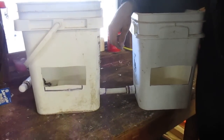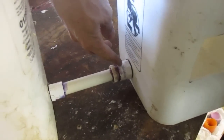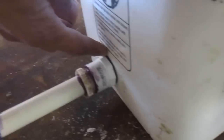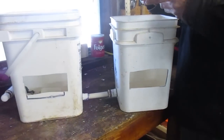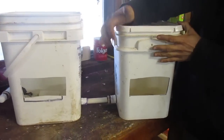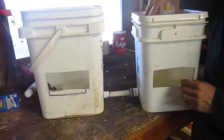So we started off here with a half-inch pipe. I ended up having to use a half-by-three-quarter bushing and pushed it up to a three-quarter-inch male adapter. Again, you can see there's an O-ring back there so we've got a seal on both inside and outside. On the inside we went ahead and used a female three-quarter-inch pipe thread adapter and threaded that in again with another O-ring. That's going to allow us to have two waterers off of one float system. Here's the top — you can see it snaps in place really tight, so the chickens can jump on it and do whatever they want but they're not going to get into it.